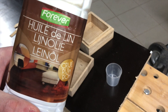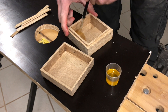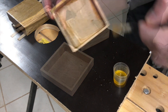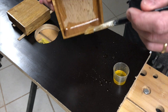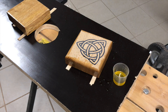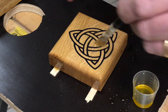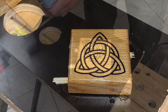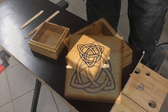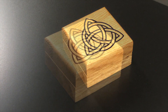For the finishing I use crude linseed oil which I apply generously with a small paintbrush so I can get into all the nooks and crannies of the box. It's a bit messy but we remove the excess a little bit later. After giving the oil time to penetrate into the wood we remove the excess — and there we go, our box is finished. I hope you like the box, I hope you liked the video, thanks for watching, don't hesitate to leave me a comment.